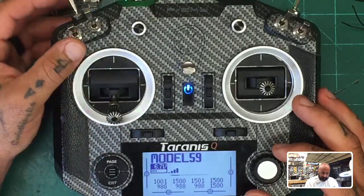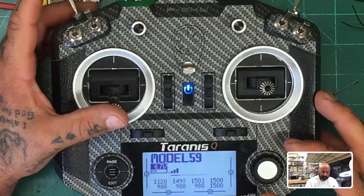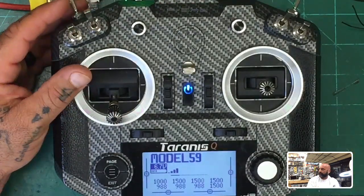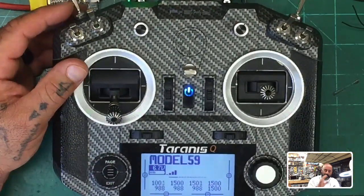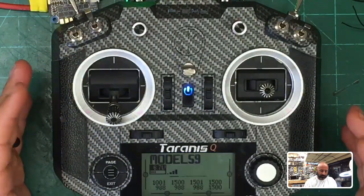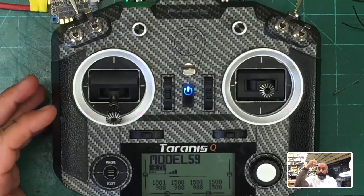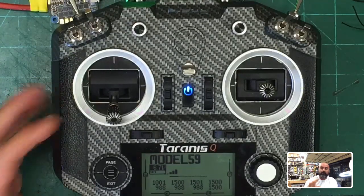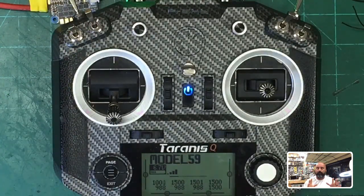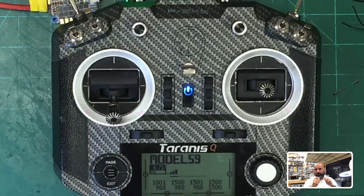Okay, here's the switch on. Okay, 1090. So what it's doing for me is basically putting my stick. The reason I do this, and I know this is totally off setting up the telemetry, but I'm showing you some of the benefits to having your radio actually doing more than what you're used to having it do, is if I'm flying and I want to test my oscillation when I cut my throttle and then hit it again, right? Let's say I'm tuning my PIDs, right? Well, I want it to be consistent every time, meaning I want to cut my throttle and hit it again exactly how I would every time, so I can test without any difference in my adjustments of the throttle stick or whatever. So I set my stick for that.